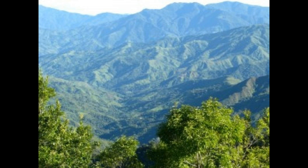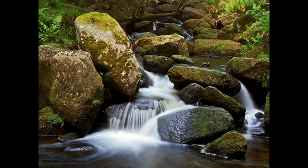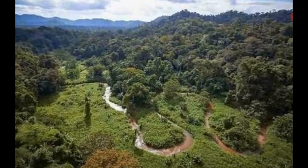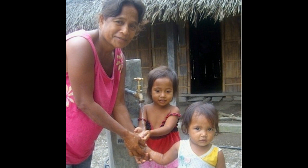Ram pumps pertain to communities or projects in mountainous areas because we need streams or a water source where we have a gradient or a fall. We need to take water from higher in the stream and bring it to the ram pump at a lower elevation downstream to get the horsepower. A flat stream is not suitable for ram pumps. The goal is to bring water from these streams up to communities to a storage tank and then by gravity to taps at the house.